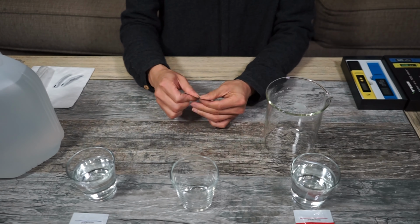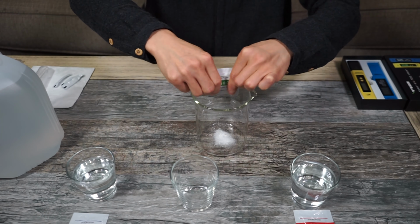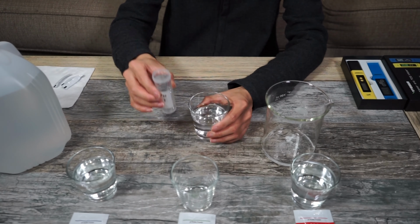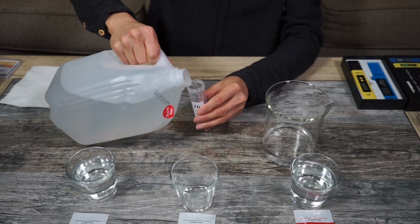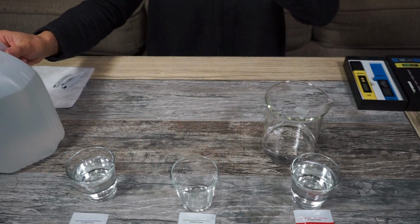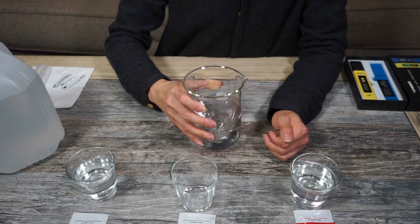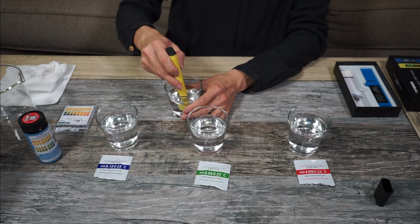Because I used the same beaker to formulate different buffers, when mixing new buffers, I rinse the beaker with tap water and then distilled water beforehand. I rinse with distilled water at least 3 times. If the beaker is not cleaned properly, it will affect the pH of the standard buffer and thus the calibration of the pH meter. After we have configured the 3 buffers, we can perform the calibration.